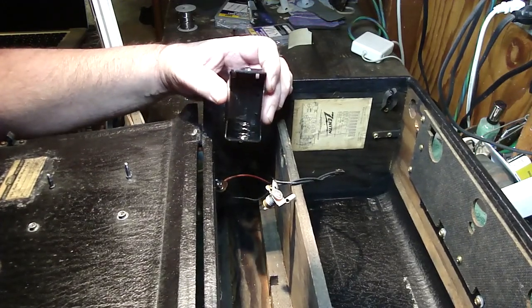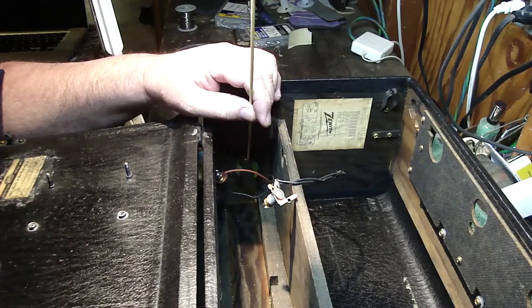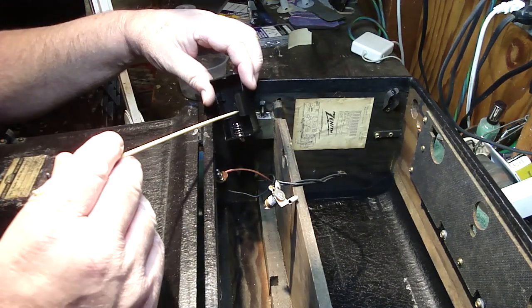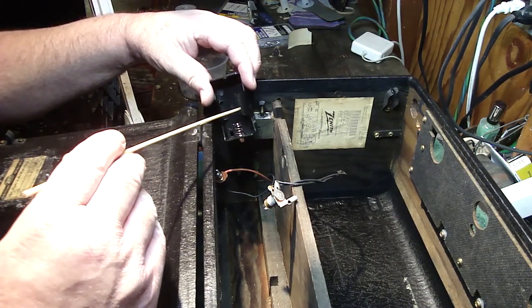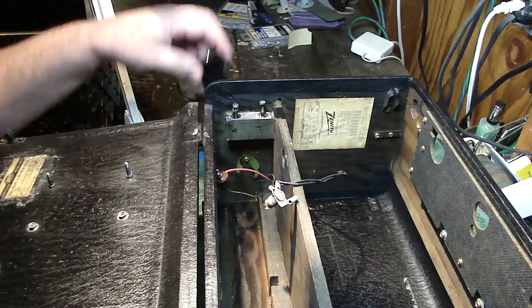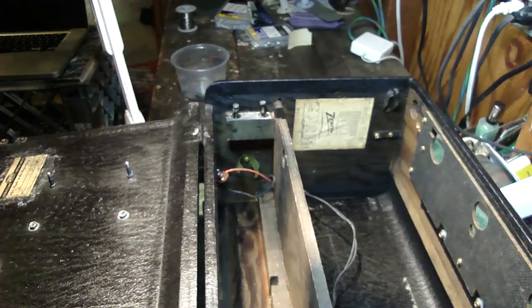So what we're going to do is take this clip out of here. Whoop. Get the finger out of there, Bob. There it is. Alright, so we're going to remove this Phillips head screw right here. I'm going to drill a hole in here, and it's going to be a little bit offset. We can't have it right in the middle because then the battery's going to sit on top of the head of the screw, and we don't want that. So I'm just going to go maybe about 1/4 inch one side or the other of the center and drill a little hole, and then we're going to mount this battery holder and wire this in, and that should make our dial-light function. I think that's really going to make the radio stand out once we get it all back together. So let's go ahead and start on that.